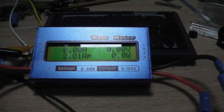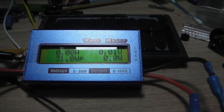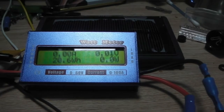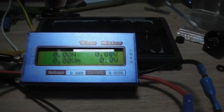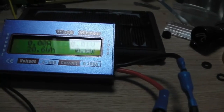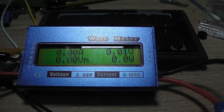The battery lasted a fair while last night, and I managed to draw off 1.472 amp hours, or 20.6 watt hours from the battery. I'm just going to put this battery on charge and see how much it takes to charge it, and then we can go from there.